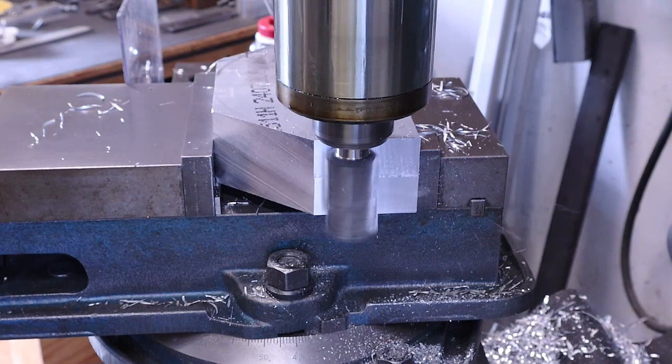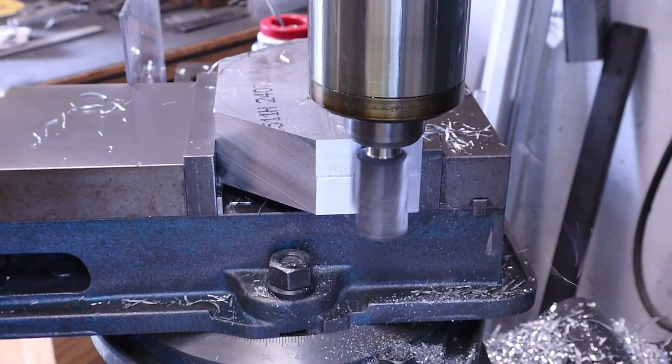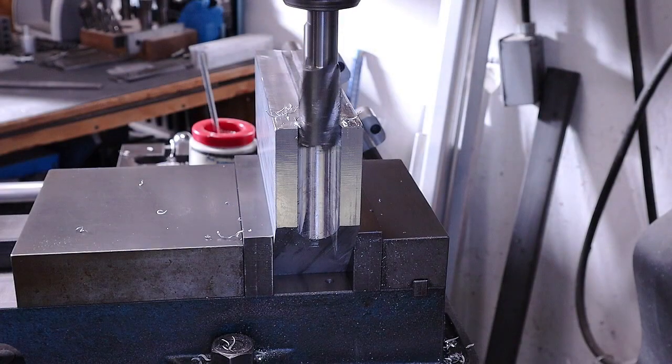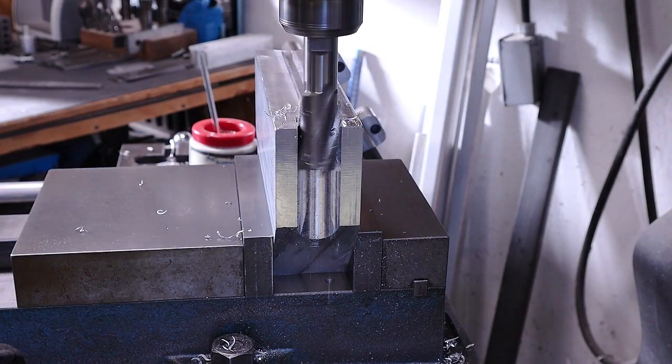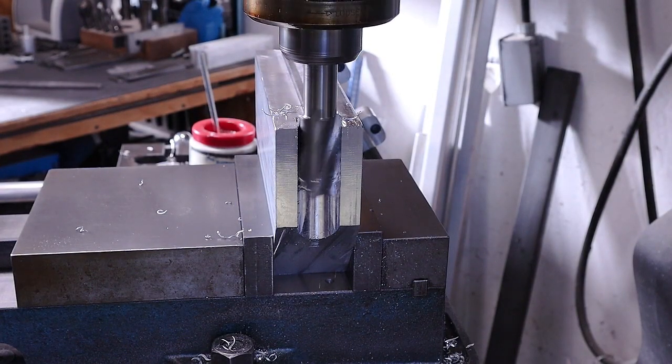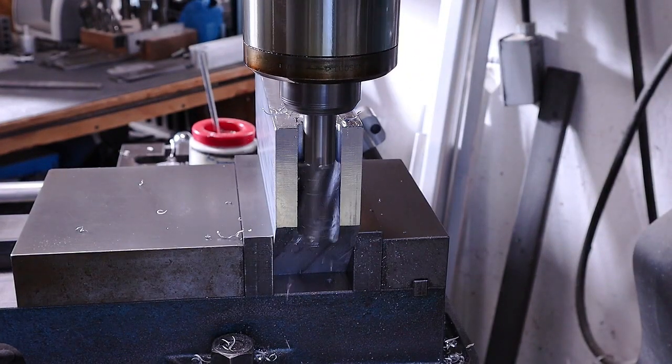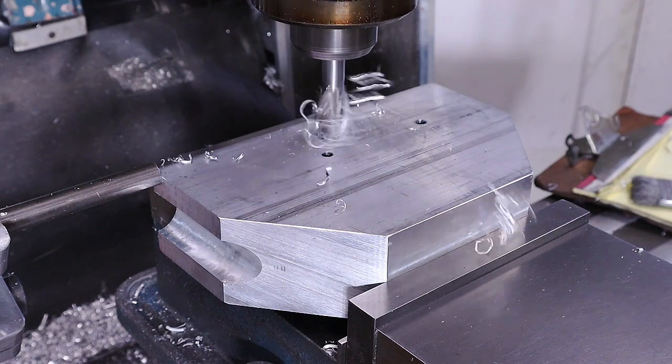The spinning die is eight inches in diameter, two inches thick, and a 180 degree bend for one inch tubing. I pre-notched the die on the ends because I want to stop and start at 180 degrees. I've cut 45s off the corners to make it easier to radius.